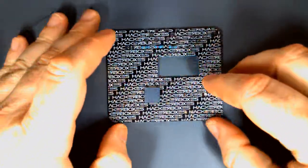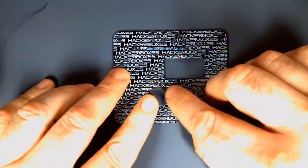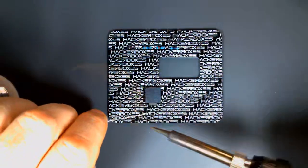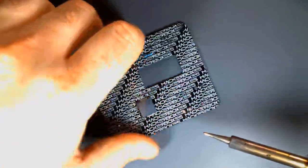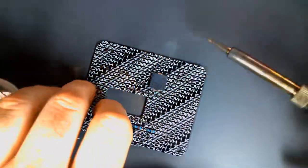Next we're doing the surface mount buzzer. You can see a little dot indicating pin one — pin one is at the top when the board is oriented with the display up. For this surface mount component, we basically set it on the surface, tin the pad it sits on, then get just enough heat onto the little metal lead on the side of the buzzer to melt some solder. Get one side tacked down first, then flip it around and get solder flowed onto the other side to make a nice flow filling the L-shaped space between the buzzer and the PCB.